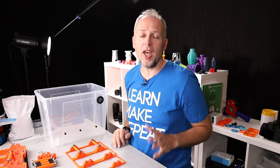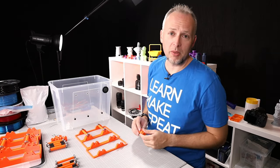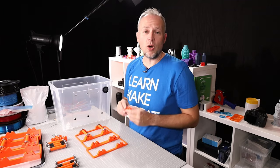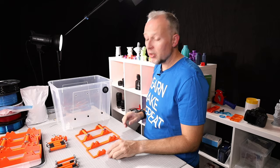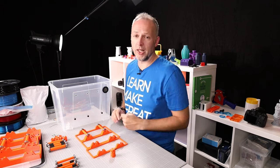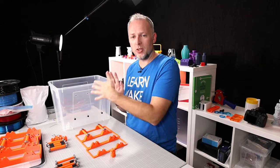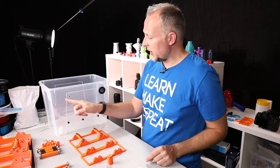After a few days of printing from the box I saw some issues. The first issue was where I placed the original filament outlets — at the top of the box. Because of the shape of the box, especially this cavity here, it caused me to place the outlets closer together and not perfectly aligned with the middle of the three spools. The outer two had to be placed more to the inside, which caused the spools to wobble quite a lot, almost tipping over.